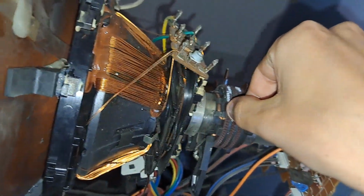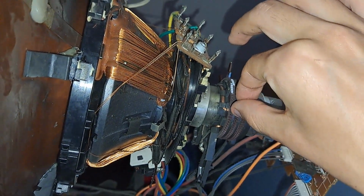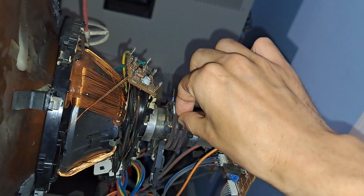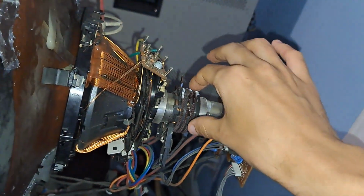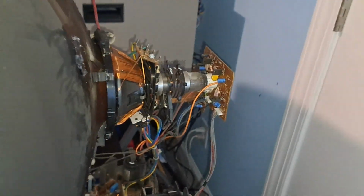The middle one in particular is the red and blue ring, and then the two in the back are the magenta and green. And when I say magenta, I mean the combination of red and blue. Let me show you again. This is what I'm turning. If I just shift these two, that adjusts the position of red and blue relative to the screen. If I spread these two rings apart, it's going to move one of the colors around and widen the gap. And if I close them up, it's going to decrease the gap in between.